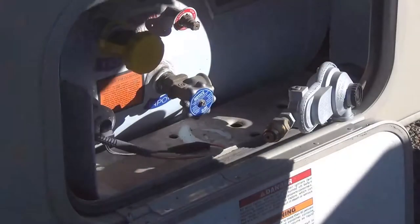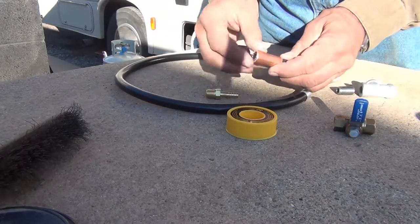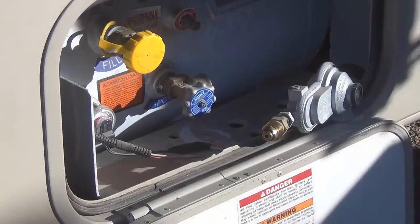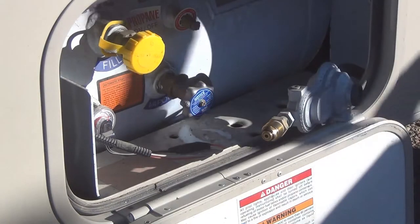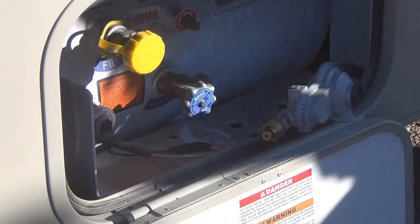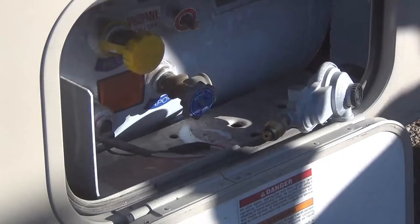How we're going to put this hose in here — I've got a hose barb right here. We're going to put it in there and crimp it on. Most of the time I don't like to use vice grips on anything, but in this particular instance it won't hurt a thing. All I need to do is just hold this to where I can shove it in. It's pretty tight — it's a quarter-inch hose barb, quarter-inch hose. So it goes in real good.